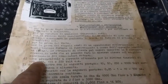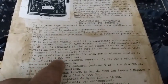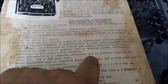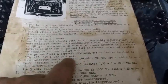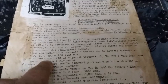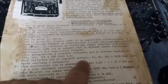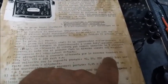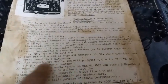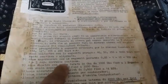Six: as a valve tester on alternating current for various voltages of 110, 127, 155, and 220 volts AC. Seven: as a voltmeter with the following scales: 10, 50, 250 and 1000 volts DC and AC. As an ammeter with the following scales: 0.25, 1, 10 and 100 milliamps; and 1 and 5 amps DC.